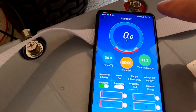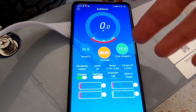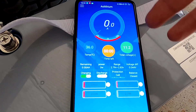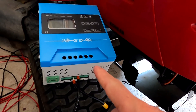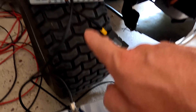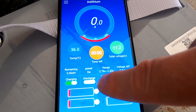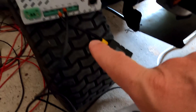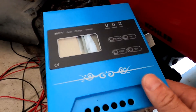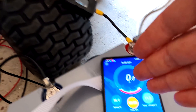I've reconnected the battery and solar charge controller back to the solar panels to recharge it, but it won't recharge. The solar charge controller is connected positive and negative, but it needs power to start up. Since the BMS isn't allowing any outgoing power, the solar charge controller is dead. Even if I connect solar, it won't come online because it's reliant on the battery.